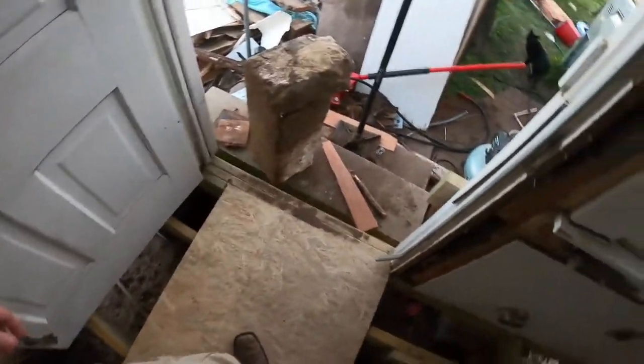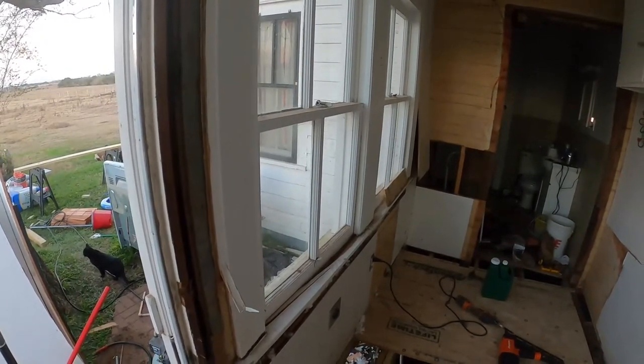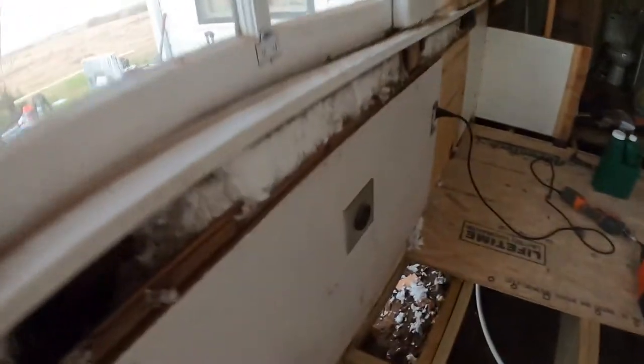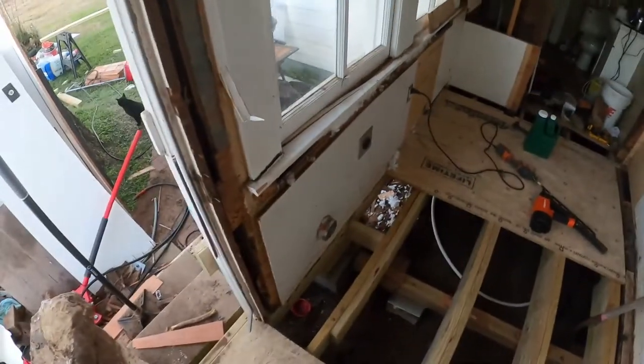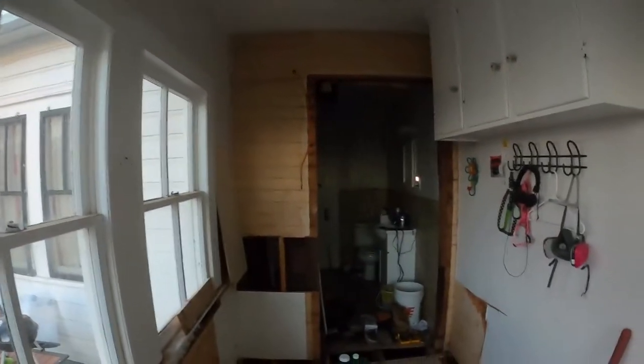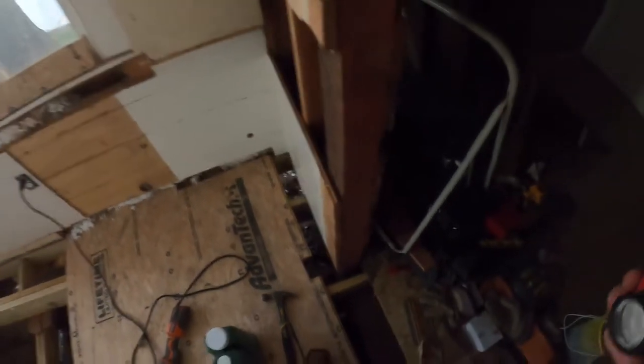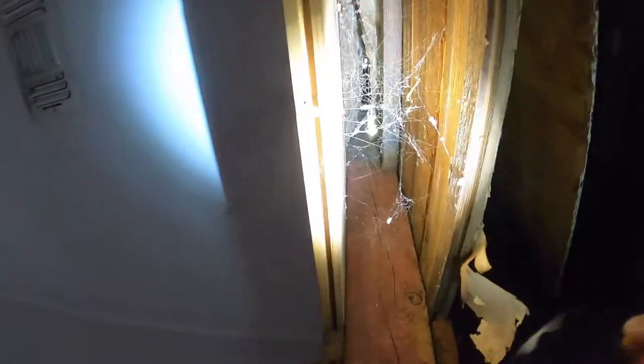That's almost it for today. We decided there are going to be no windows on this wall, and I'm going to zip-sheath the outside. There's blown-in insulation I've got to pull out of the wall, and there will need to be some fire blocks up here because it's wide open. Let me grab my flashlight and show you what a balloon frame house looks like — this used to be a doorway. You can see all the way up into the attic.